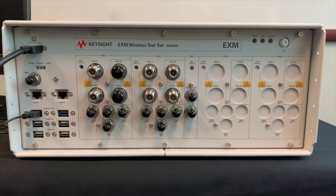Full duplex ports transmit and receive at the same time but with a higher noise figure. Half duplex ports either transmit or receive and have better noise performance.